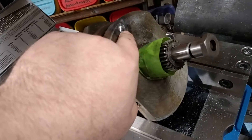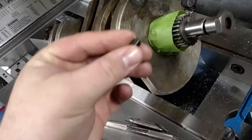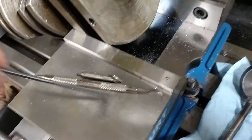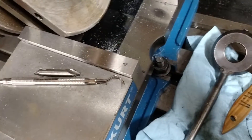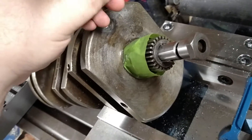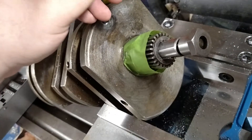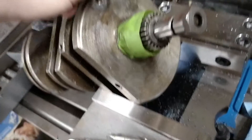It's quarter-inch, so I had to go all the way out to quarter-inch. Luckily, a sixteenth-inch pipe NPT works fine. All I had to do was give a little clearance for the tap. It's marginally increasing the size of the threads, and now you have a nice tapered pipe plug in there.